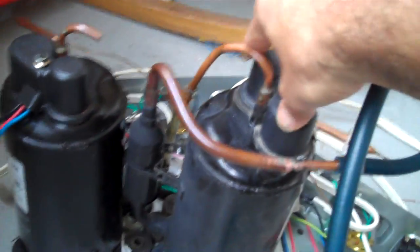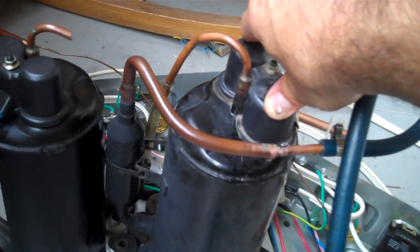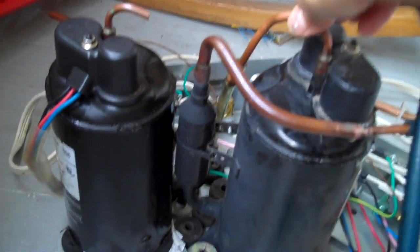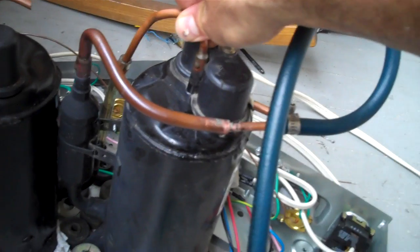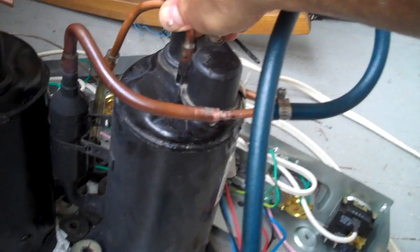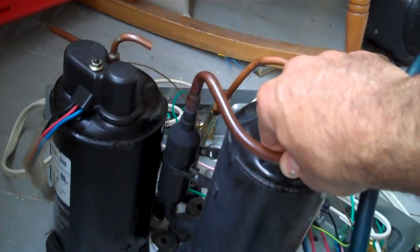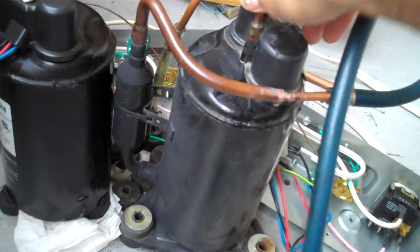How do you use an air conditioning vacuum pump? All you do is take the compressor from any window air conditioner, cut the discharge and the suction off. Here's the suction, here's the discharge. You take the electronics out and run it as a vacuum pump. But that's only going to give you about 20–30 torr, so you need a second vacuum pump in series to get an even deeper vacuum for sputtering. The laser itself will just work on one vacuum pump.